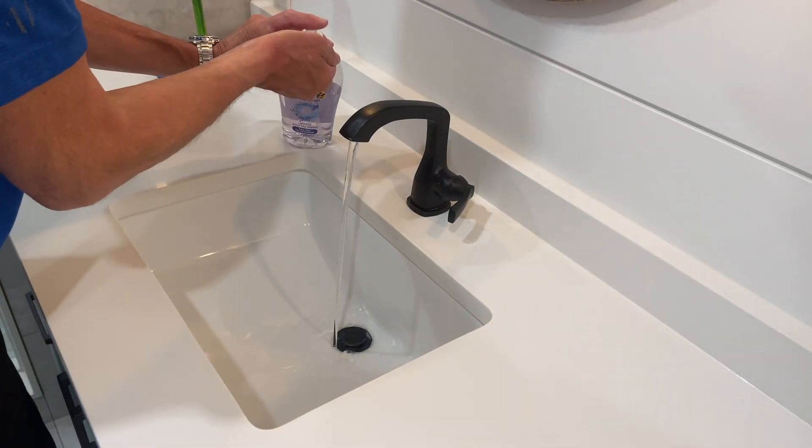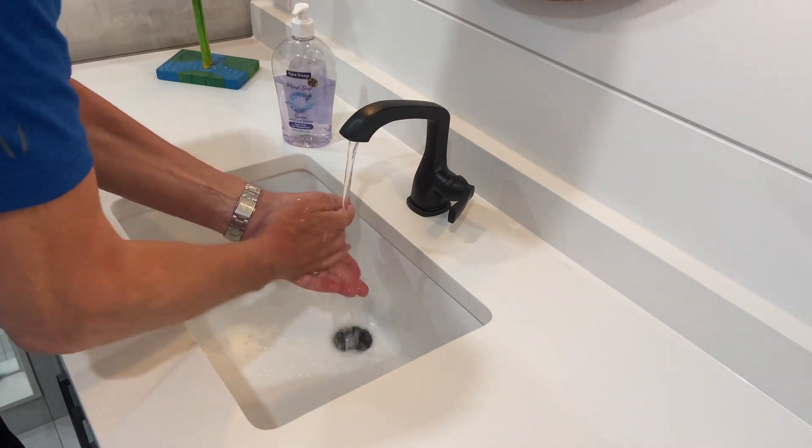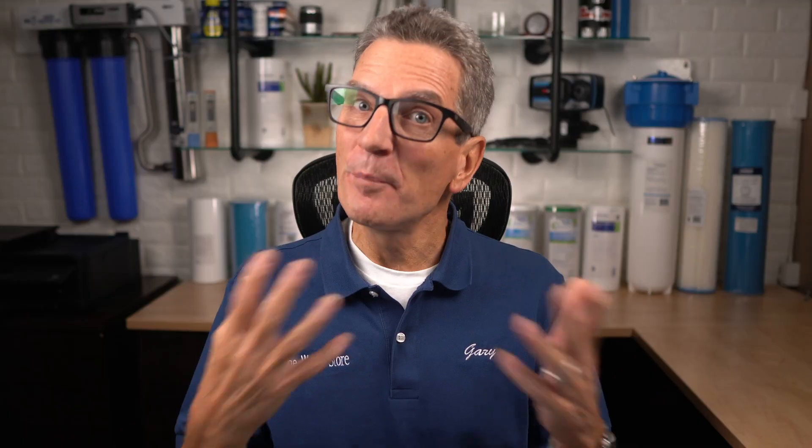Pro tip number five: poor preparation. Make sure you wash your hands before sampling with warm soapy water — you want to avoid the possibility of coliform cross-contamination during sampling. Paying extra attention to where you put your hands and fingers is crucial. Be sure to fill containers from the same location, remove any aerators from your faucet if possible. You might choose to take the water sample from a bathtub faucet as they don't have an aerator.